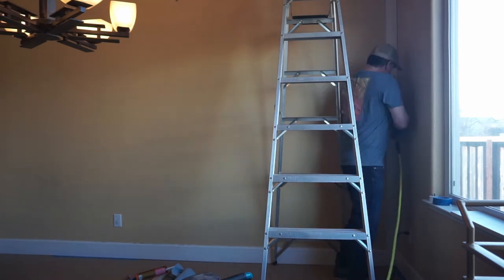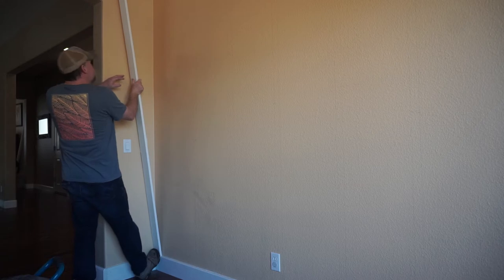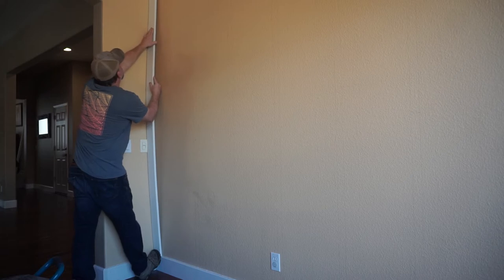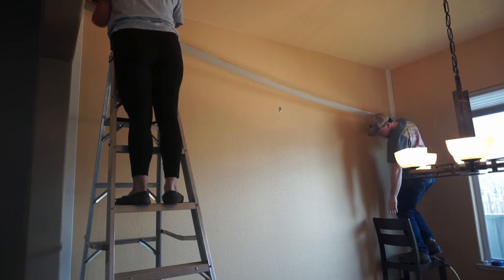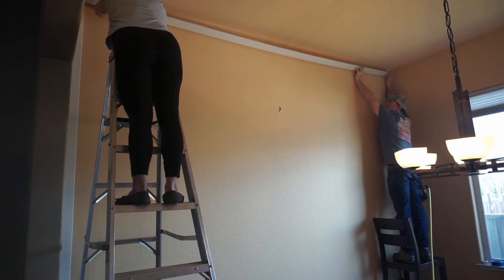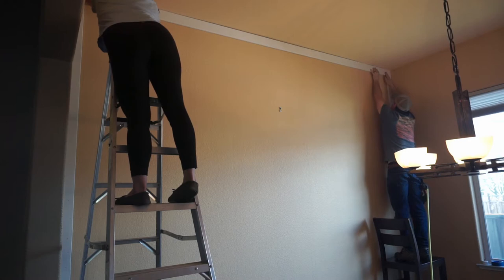Once you start getting your boards in place, start getting to work with the brad nailer. You can see what I mean about the springing action right here — this was just a hair long. Squeeze it in at the top and spring it in and it will not fall out. For the longest span boards either across the top or diagonal, you're definitely going to want some help getting it up. I recommend brad nailing one end, moving to the middle, brad nailing it, supporting the middle, and then moving to the other end and hitting all the spots in between that you missed.